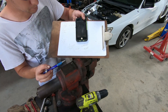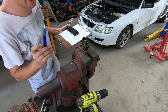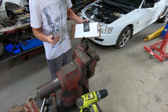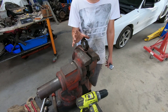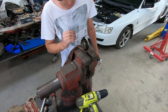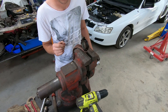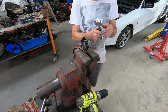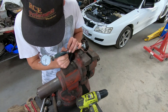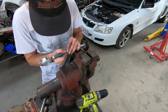From here, put the bearing you wish to use into the rod. I took the bearing out of the turbo piston because I'm reusing the bearings — they're all very good. I've put it in the naturally aspirated rod and torqued it down to factory settings, which is 35 foot-pounds. It's important it's torqued accurately to give you an accurate measurement. In the vice, make sure the rod is protected — you do not want to damage it. Also be mindful of where the piston is so you don't accidentally squash it. Same thing — dial gauge goes in, and we're looking at 0.041.